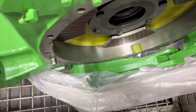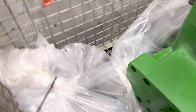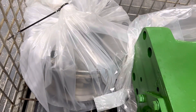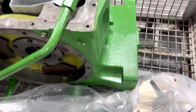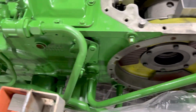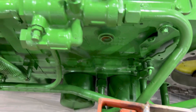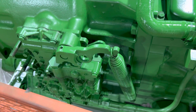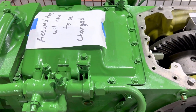Draft control, PTO shaft — this is the C1/C2 clutch that goes on the back of the engine; can't be installed on this so we just bagged it up. All the lines that connect everything have been cleaned out, it's got new hydraulic filters, it's got a clutch valve on it, and of course the rear planetaries inside.